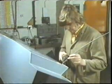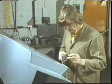Welding as a joining process is not only confined to metals. Here we're welding a plastics material. Because this material melts at a much lower temperature, the heat source can be a jet of hot air. Do you think this is a fusion process?